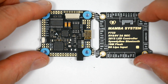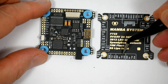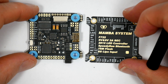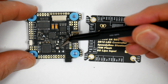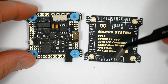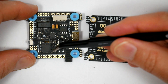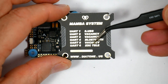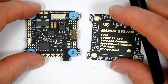And then we've got UART5 — Ground, 5V, TX5 and RX5, the IO pins for UART5, again nicely marked up with power. Maybe you could connect your GPS there. And last along here is UART6 — TX6, RX6, Ground and power, all nicely labelled. And they've actually dedicated that to ESC telemetry, so you can get all your ESC voltages, currents, temperature and so on.